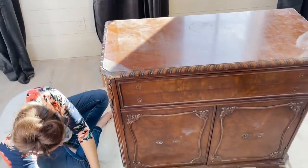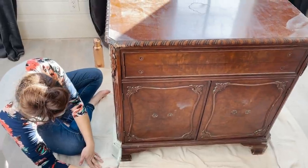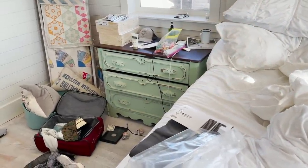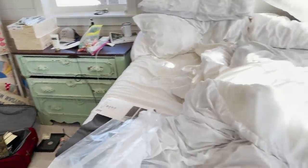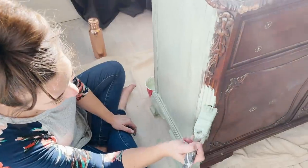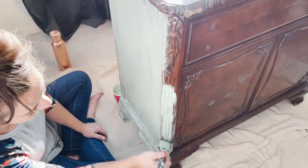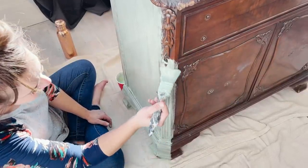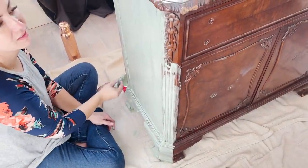We got the curtain song going and Jamie's like, hey, my nightstand doesn't match your nightstand. Look at that — living out of a suitcase. So I've mixed together some milk paint here. We've got summer cottage and pantry door — about two parts pantry door to one part summer cottage. I hope it matches. I can't remember what the previous mix was.